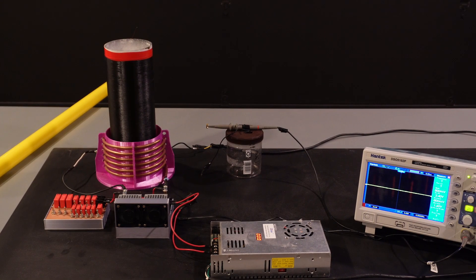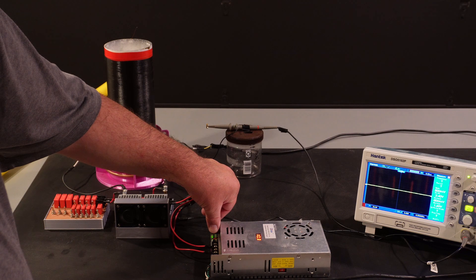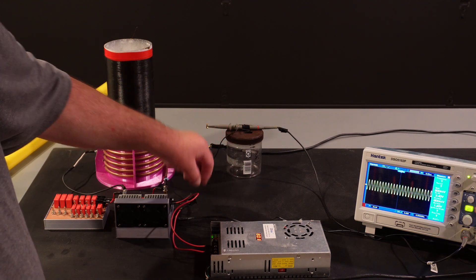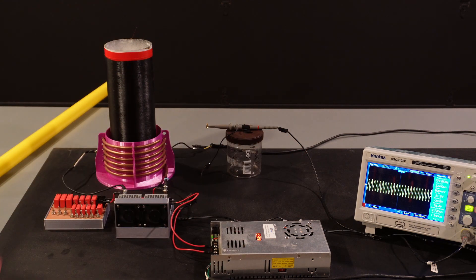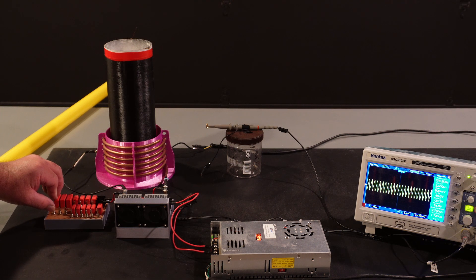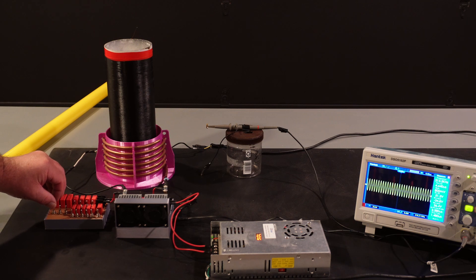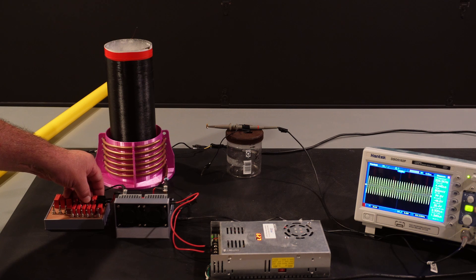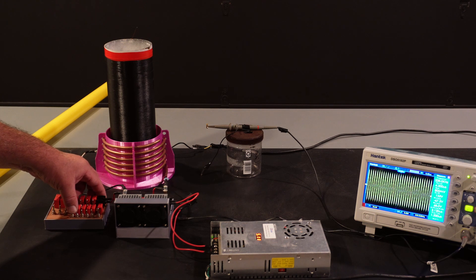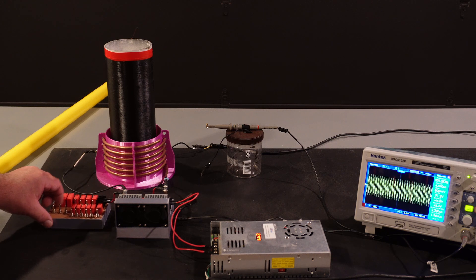Let's begin. We're going to turn this on to nine volts. The little green light right here comes on, and you can see on our oscilloscope that we're on. Let's switch one of these — on the 47s. I already changed it. I can tell you right now this is a pretty weak resonance, but let's go ahead and flip a couple more capacitors. Here on the 22s — it's pulling in but it's taking too much body capacitance into account.